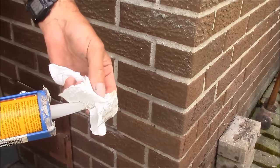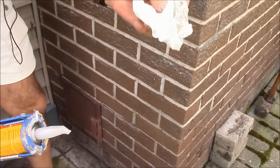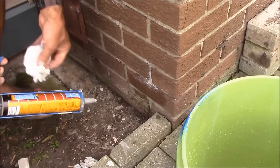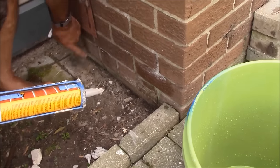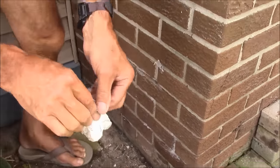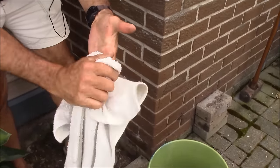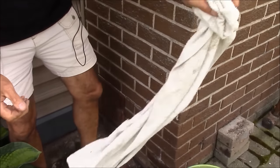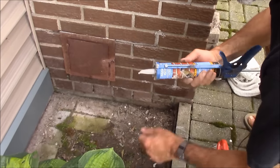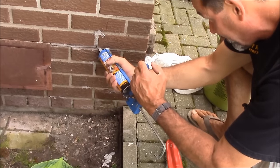One trick to help keep yourself clean is to use small pieces of napkin. After you get enough caulk on them, throw it away and get another one. Don't try to make it go too far — you end up getting caulk all over you. You'll notice I'm staying away from these bottom potential weep holes. I clean my finger when I've got enough caulk on it, then I clean my hand and continue with a fresh napkin. As you're working, always wipe the tip clean before you go to a new location — that way when you come in, you're not smearing caulk right off the bat.